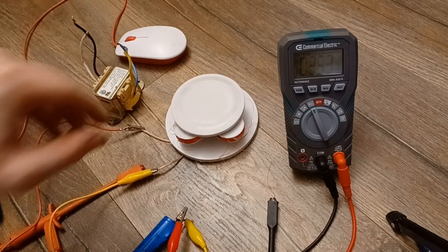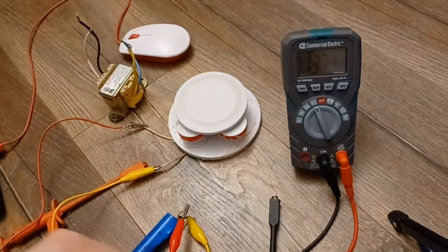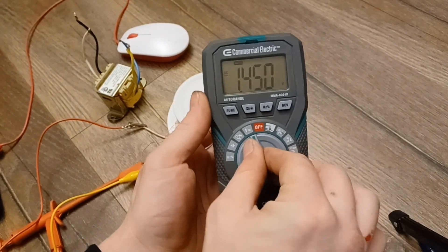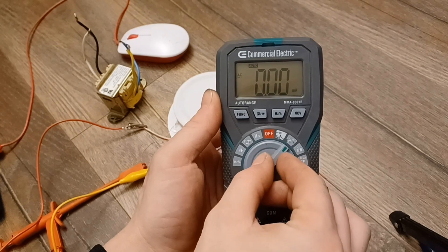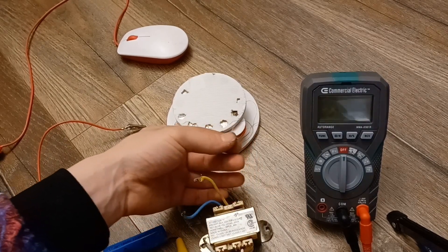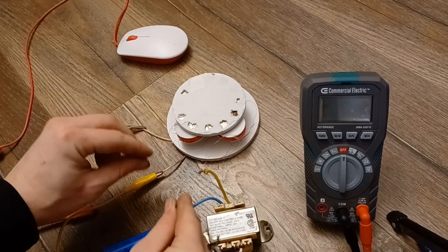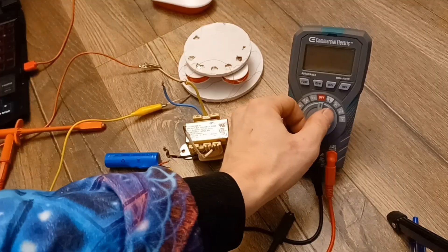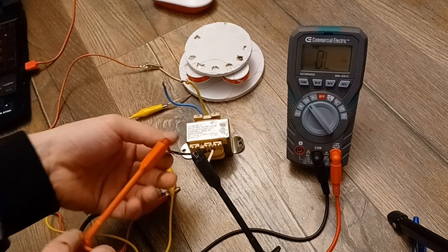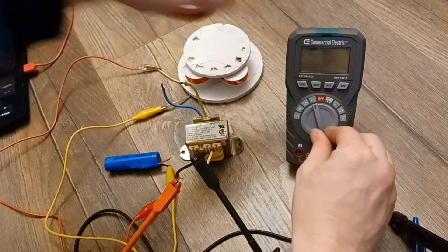These two coils here do not produce a very high voltage and current due to the fact that there's just not too many of them and the frequency is too low. If the frequency is too low, then you won't get the output that you are looking for in your coils. As you can see here, I am checking the output of both coils, and it had an output of about two volts — less about one volt — with barely any milliamp reading. This is where it gets a little interesting. The milliamps and volts on this step-up transformer with an output coil of 38 ohms is actually able to step up the power coming from these two coils. I've also tested this with three coils, and the power will gain five times higher in the step-up transformer, which I will be uploading in the next video.